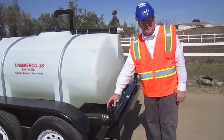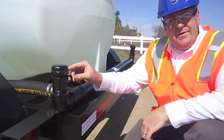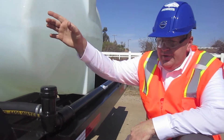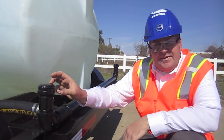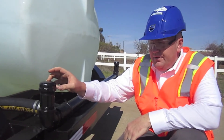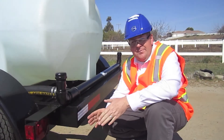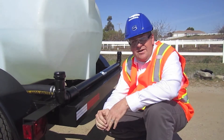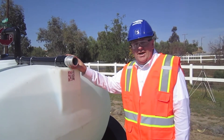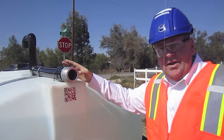This is a standard 2 inch galvanized cap. You can also go to your local hardware store and use a plastic PVC 2 inch cap. You can take this off and put a rain bird for watering purposes — there are a lot of different features you could put back here. You can also put an inch and a half cam lock, or hook a fire hose back here. With a plastic cap you have many different spray pattern options — you can drill holes, do different saw cuts, or angle it to the side of the trailer for side watering. This is our standard 2 inch hydrant fill pipe with a two and a half inch cam lock. It's PVC, so if you accidentally leave a hose to it and drive away, this is a breakaway point.